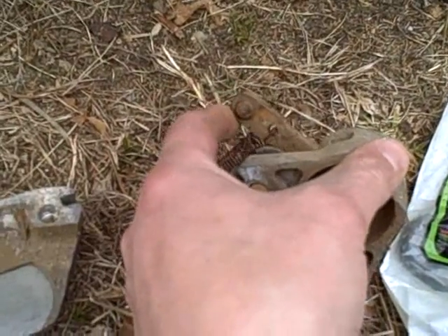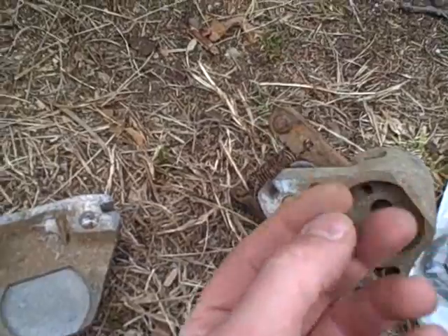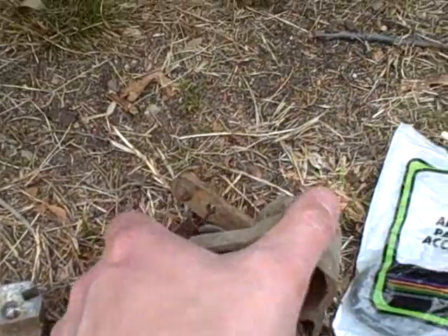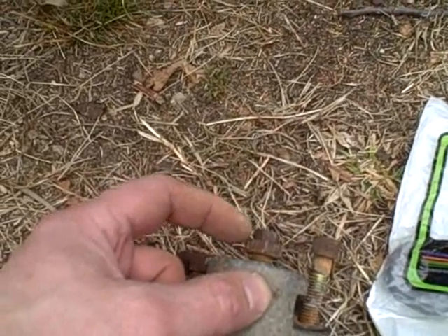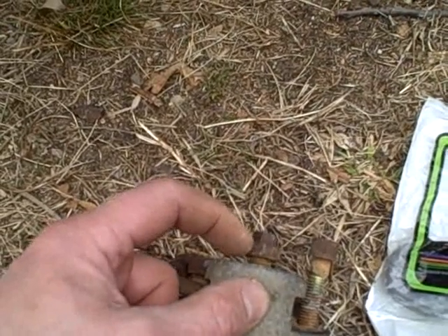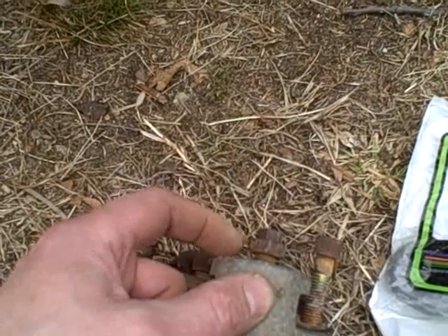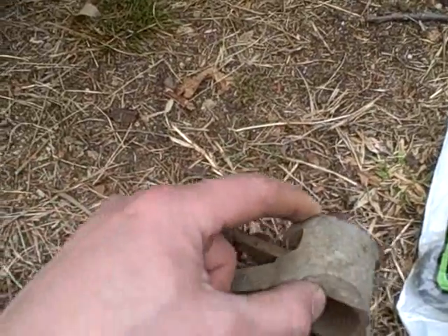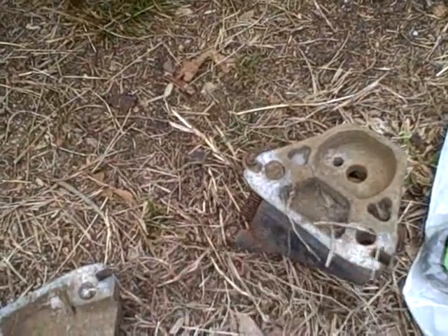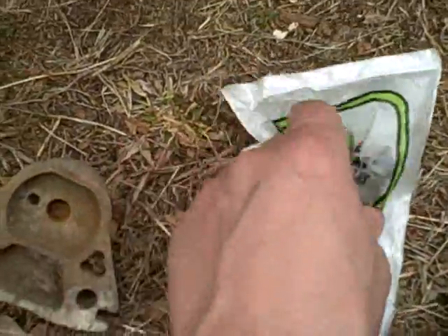The cam mechanism is basically just this lever. As this lever pulls, it cams this out and applies pressure. Where that starts to happen is regulated by where this adjusting bolt is set to. This outer nut that I've got my finger on is a locking nut to lock it in place once you've adjusted it. I've got it rotated all the way out very far because that makes disassembly and reassembly a lot easier.